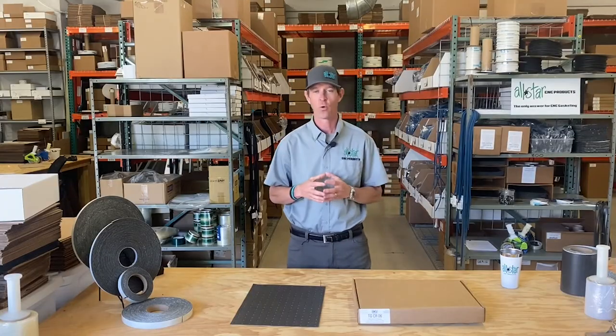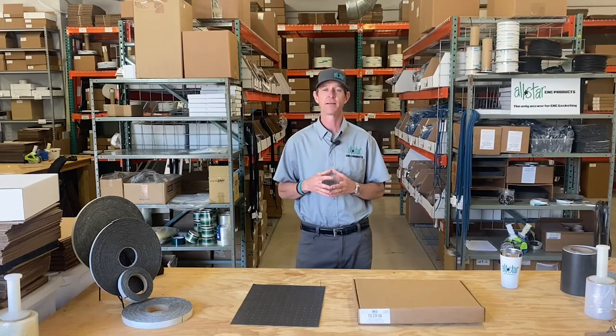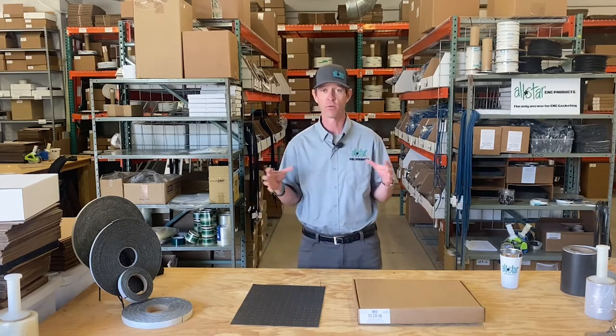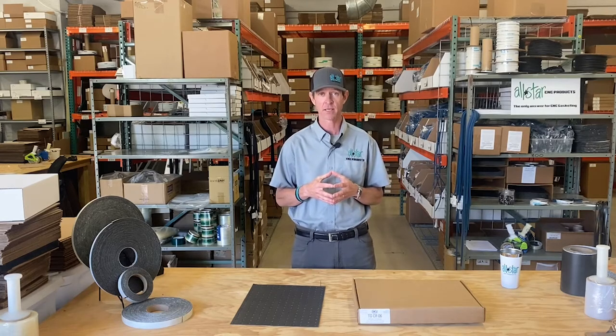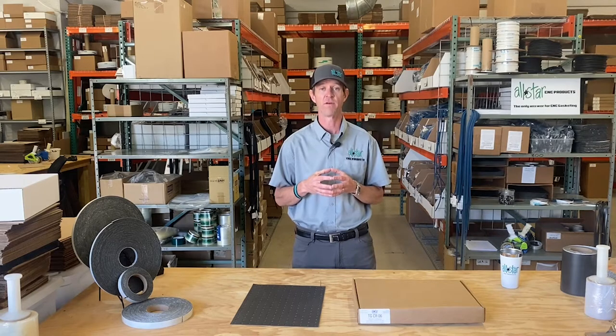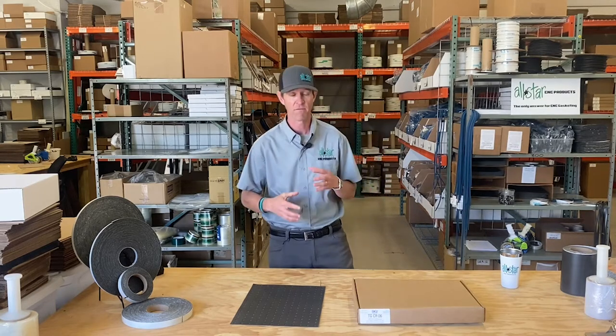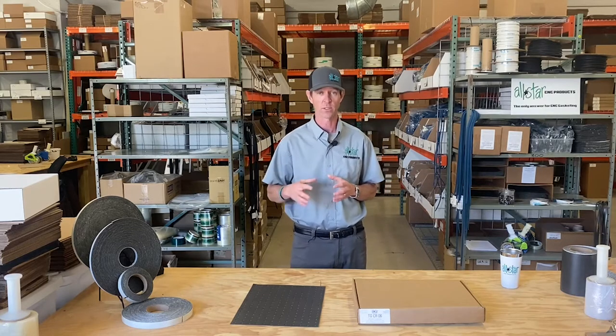So that is a quick application review of our tile gasket. We were at the customer for about a half day. Like I said, they called us in because they were having trouble holding parts on their router. Once we installed the tile gasket concept, they were having great success in holding their finished parts in a single pass, varied job, so a great deal of vacuum improvement once we installed those tiles.